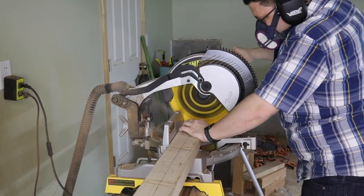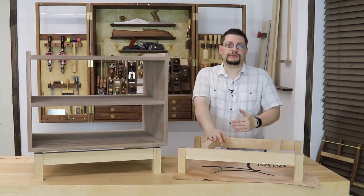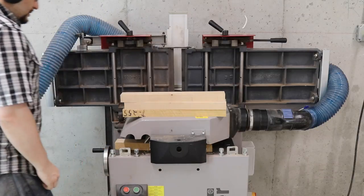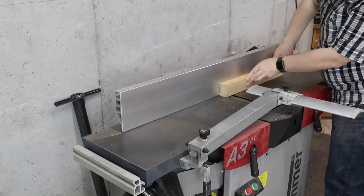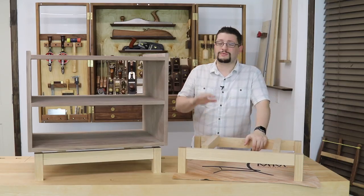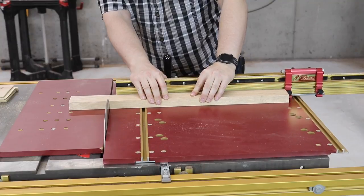Three days before, I had done the rough dimensioning on all of this hickory for the base, let it sit for a few days, came back, and then redimensioned all of it — the legs, the rails or aprons, and what I'm calling the risers or stretchers. I milled all of that up to its final dimensions, doing all of the milling at the jointer to four-square all of this, and got beautiful results where every face was nice and square to each other. Once that was done, I was able to start cutting all of my joints.